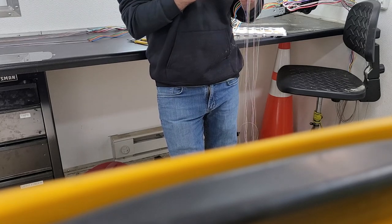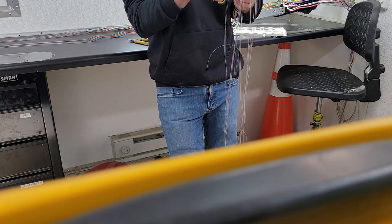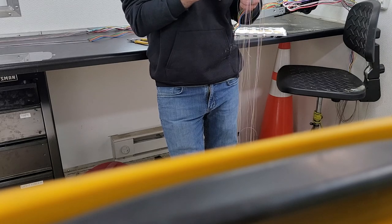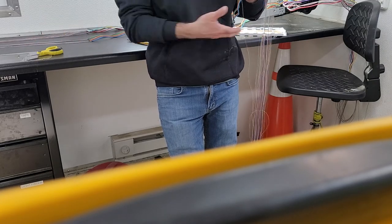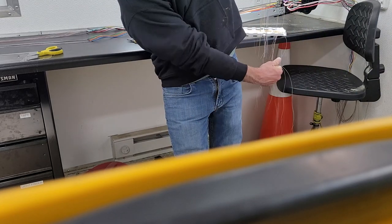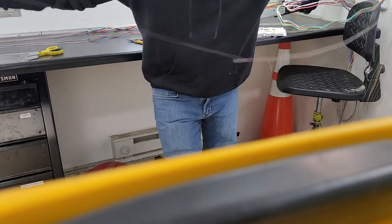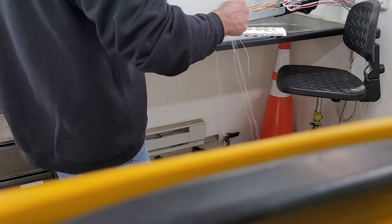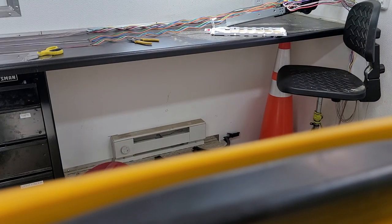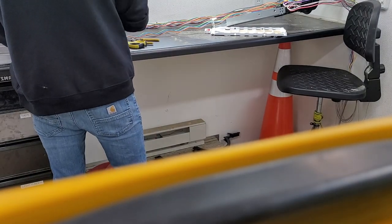So, what I like to do is cut all 4. There's one in each tube. Unless it's gel, in which case that sucks. I'd rather have a string. And you can just peel those away carefully. Sometimes they will get caught on the fiber and break it. All right, now all four of those are ready to go on the tray. But we'll go ahead and cut the ones off the other four of the same color.